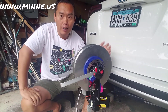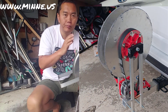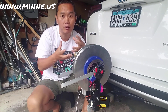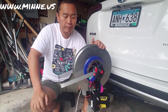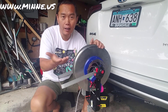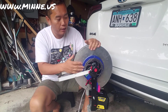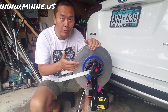That's why I also have a regular brushless motor with a belt for the energy transfer. With that kind of winch you can build a super-powerful unit, because with a regular brushless motor you can buy pretty much any size you want, build a really powerful winch, and avoid those heat problems. So the pros for the hub motor are simple build and maintenance-free; the cons are heavy and not good for heat transfer.